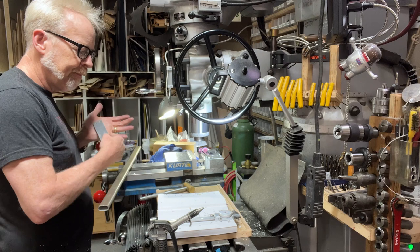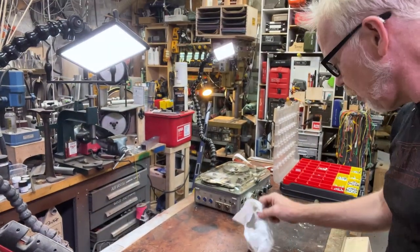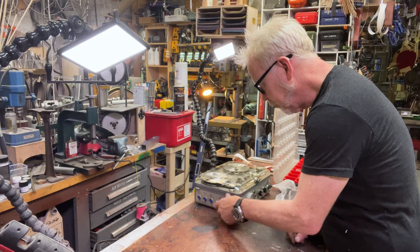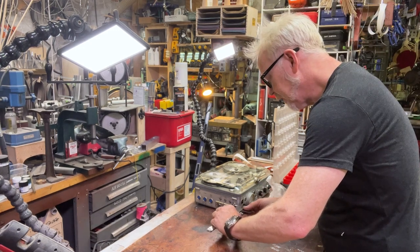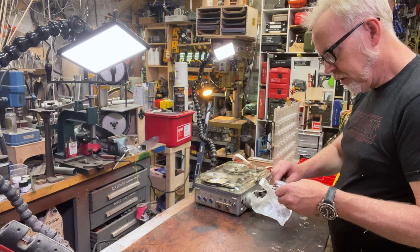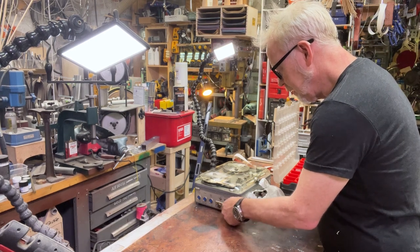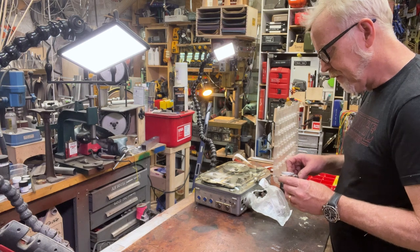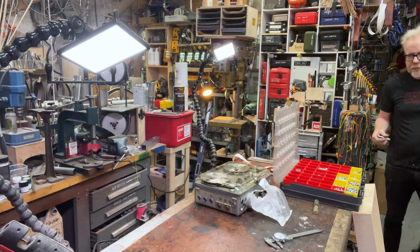I'm just thinking. Now there's one measurement that I need, which is how wide the spacer between the strap and handle screw is. Yeah, so there's this. And the question is, how wide is that? And the answer is, if I make it 100 thou, I am good. And what I want is a 5/8 bit. Yeah, how about that? That's a better 5/8 bit.